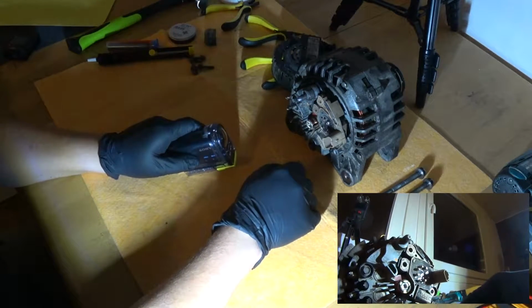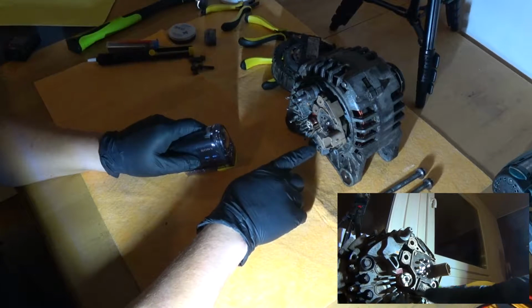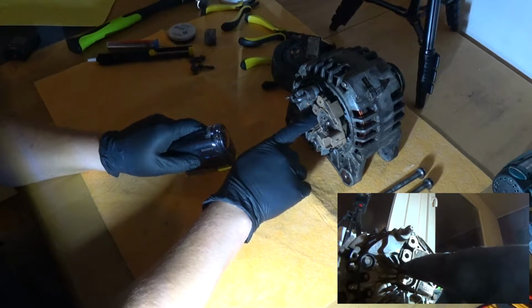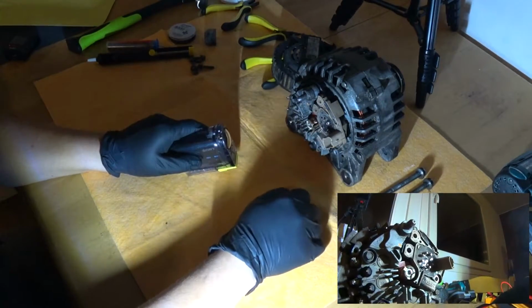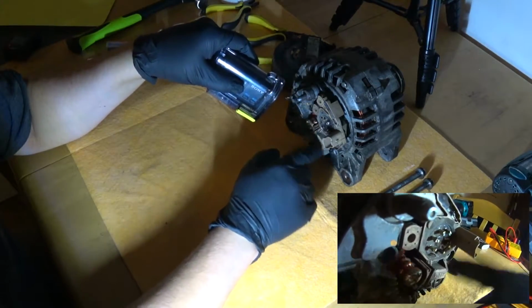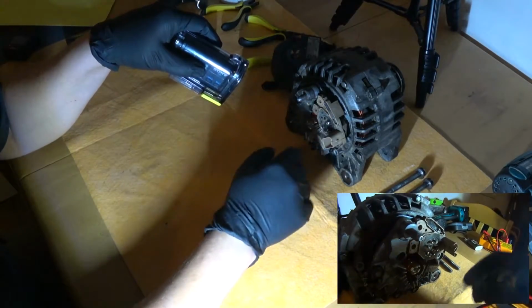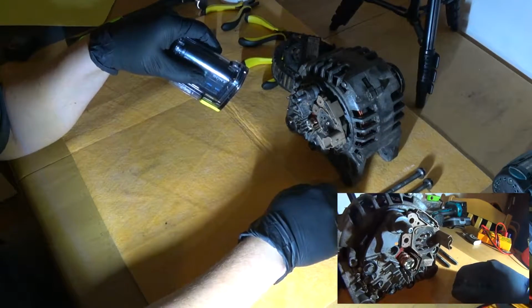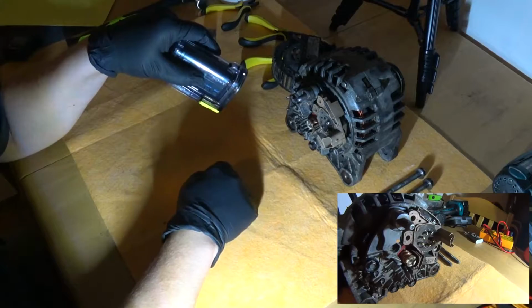Well, it's typically, I think it's called just voltage regulator. The brushes are here, and they are pushing against these slider something. I don't know what that's called in English. But basically, they are picking up the electricity from here and here, and it's an alternating current, and then you're going to get direct current out, so plus 14 or 15 out of here, and zero on the cover.